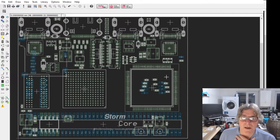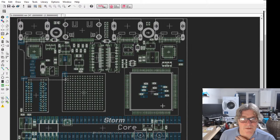And then if we move to the top of this now, if we start from this end here, right hand side, we've got a USB-C connector here, and then the STM32H7 supports at high speed 480 megabit per second USB via a ULPI interface, which is what this chip is here. So we've got nice, half a gigabit's worth of transfer speed, high speed USB 2 going in and out here. We've got some jellybean supply components and things. There's an RGB status LED here. Then this USB here is also attached to the STM32, which is the debug channel for the USB. And I'll come back round to that.